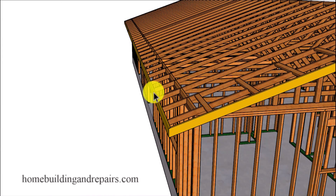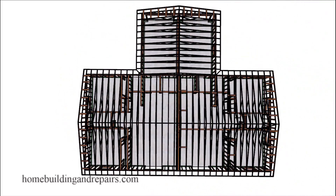Next up let's take a look at the fascia board running through the back of the building. Even though I didn't go over the garage roof truss installation, it will be the same — 24 inches on center with the same type of blocking over the walls and for the ridge.